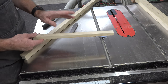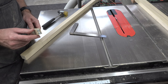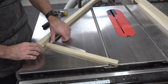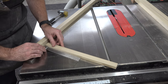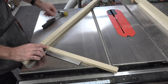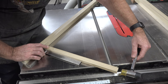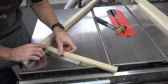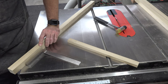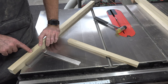Here's the bottom of one of our legs with all the holes drilled in the cross pieces for our side panels. I've placed dowel centers in the holes for the quarter-inch dowels. I'll line up my square with the layout line and once I'm happy it's square and lined up, I'll hold it in place and give it a little tap to mark exactly where the dowel holes should be. Then we'll drill quarter-inch diameter, half-inch deep holes at the drill press.